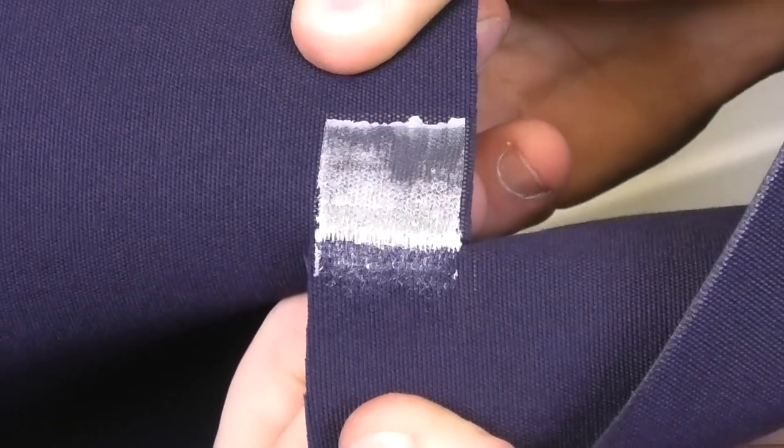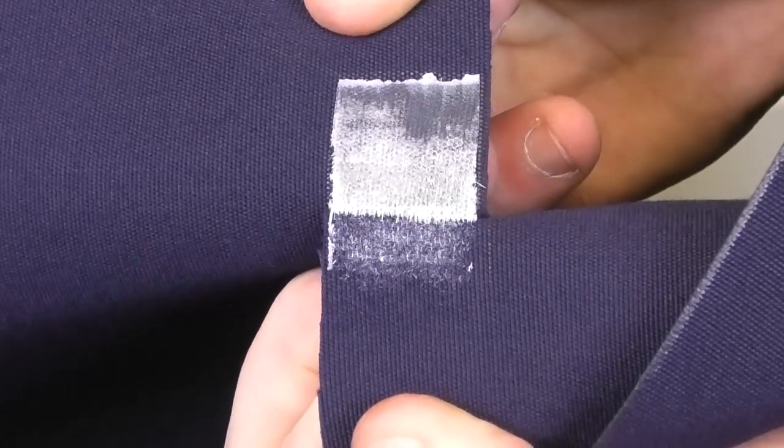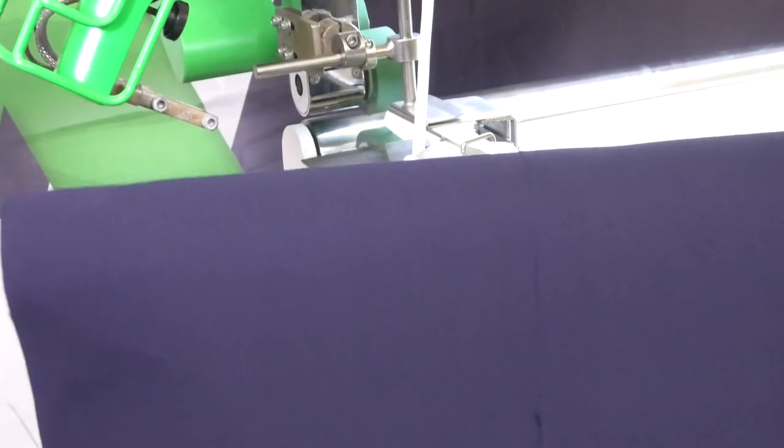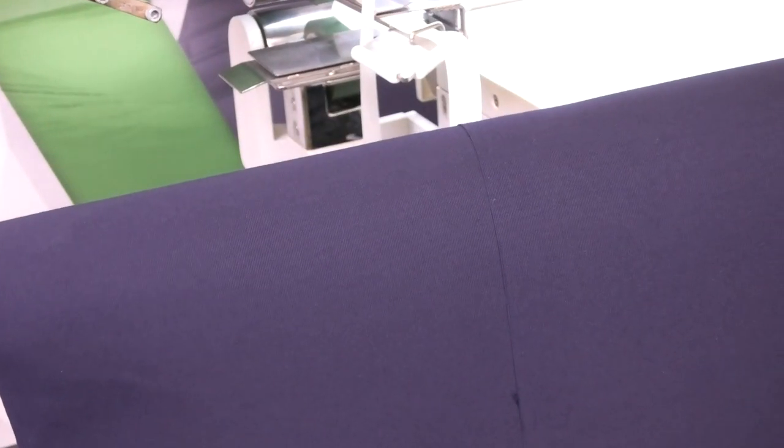See how it's sticking? There are those little legs sticking from one side to another — that's what you're going to want to see. You're always going to be able to grab it and rip like this, and that's okay. The real test is the tension test: grabbing it from each side, and that's not coming apart. If you have everything dialed in correctly, typically the material will fail before the welded seam.